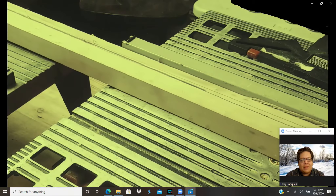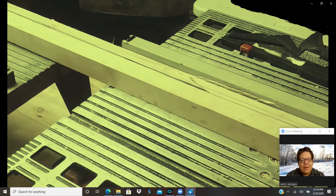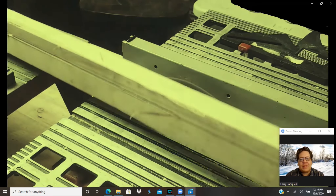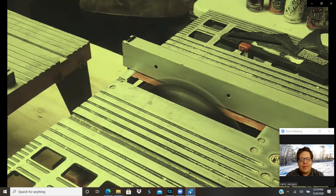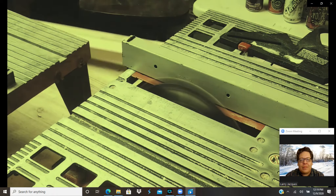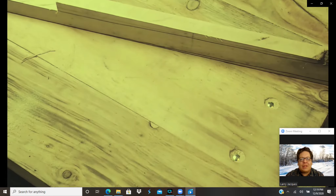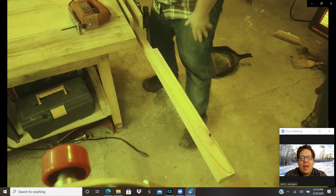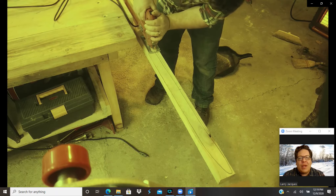Getting pretty close to where I'm going to stop. I'm just lifting the board up and off, letting the blade come to a stop. Then I need to remove that back waste that we had just cut, so I'm taking a saw — I've got a Japanese pull saw, but you can use whatever kind of saw you'd like. Now there's the back of the snake — the waste needs to come off.